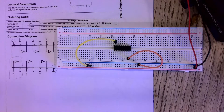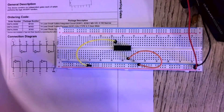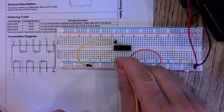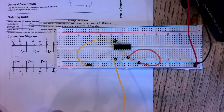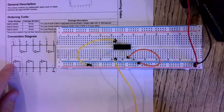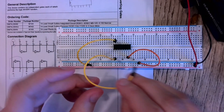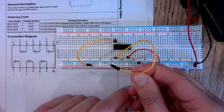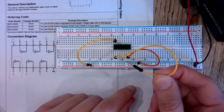The way we're going to do the inverting: our input goes in at pin one — we're going to use the first inverter. My 'poor man's switch' is just taking the other side of the jumper wire connected to pin one.